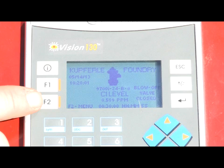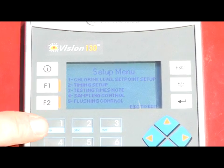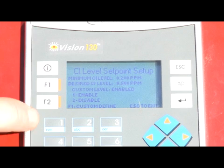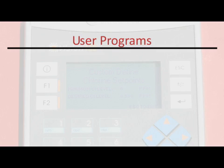Unlike regular automatic flushing systems that operate on a daytime duration schedule, intelligent flushing revolves around sampling. Using the PLC, the user would program the PLC's minimum residual level. Additionally, they would program the PLC's desired residual level. Once the minimal and desired levels have been set, the user would program sampling sequence times when the unit will test residual levels.